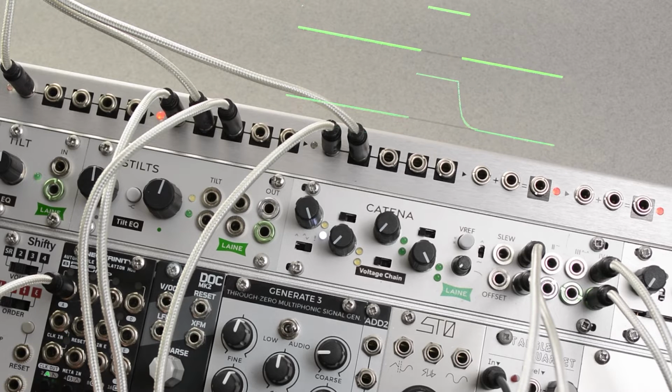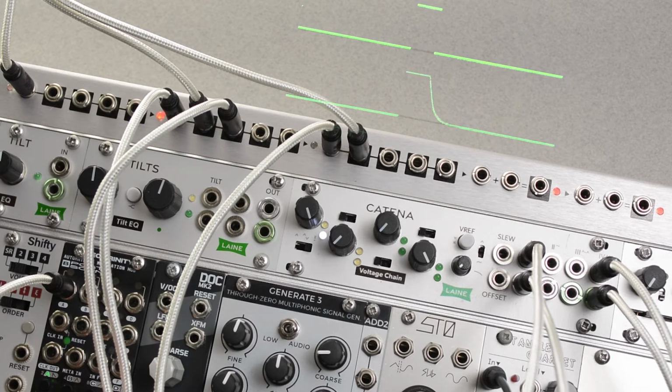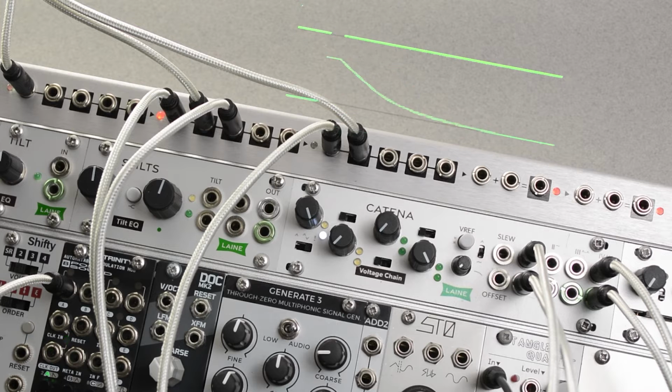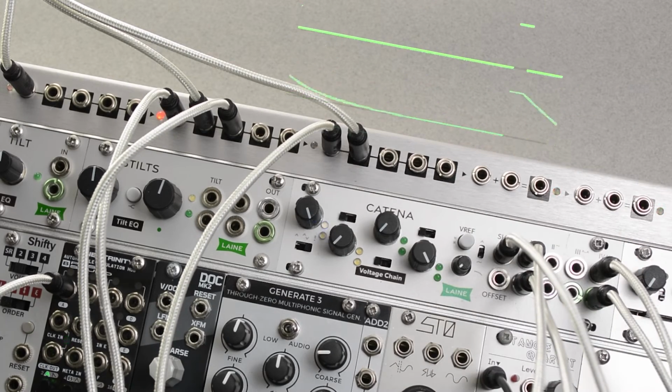Channel 1 alt mode is a percussive slew and responds to gate, trigger or DC inputs with an instant attack and a fast exponential decay envelope that's perfect for tight VCA control on drums and gated sequences. There's an additional slew response switch that tightens and loosens the slew curve. A slew CV input responds to plus/minus 10 volts and extends or contracts the envelope tail response.